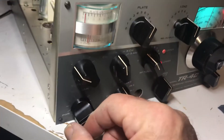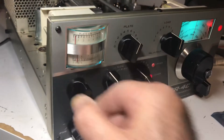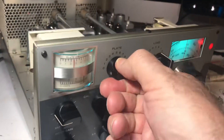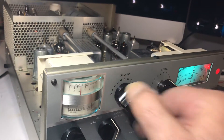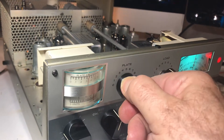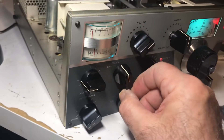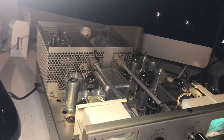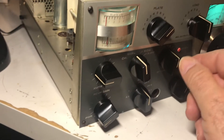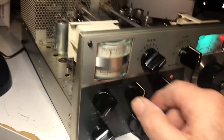Let's go for 15. This is working out pretty good. Give it some — whoa, there's a lot of power in that one. Crank it down. Get a little bit of drive. Peek it, dip it. Yeah there's some light. So 15 has some power — nothing's frying on me. I gotta neutralize those tubes. 15 works, a little bit of power, but I'm afraid to really crank on it. It'll go, just too much plate current.